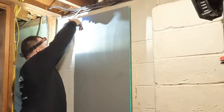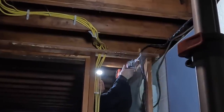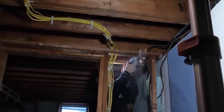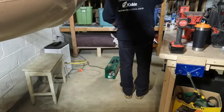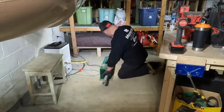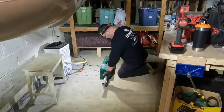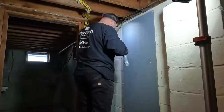I paint the plywood at home in my garage — just some gray color I picked out. All the new panels I'll be putting in, you'll see that color panel board. I was here over the course of two days relocating what used to be a main breaker panel. They upgraded to a 200-amp main on the outside of the house with an overhead service. When they added a generator some years ago, they added this 200-amp panel outside and also have an automatic transfer switch panel, but it doesn't do the whole house — it's not a service-rated transfer switch.